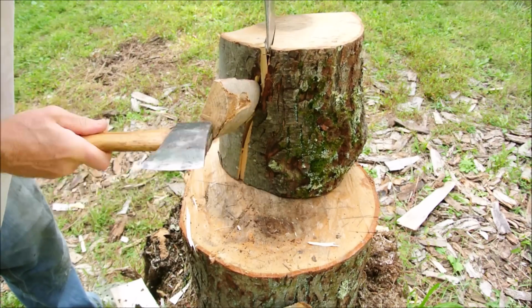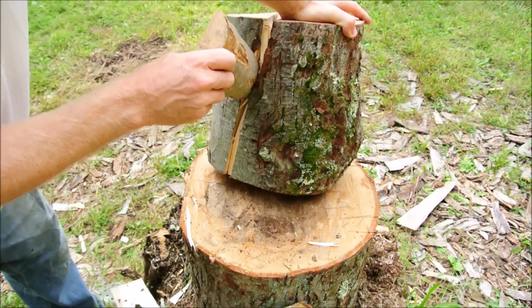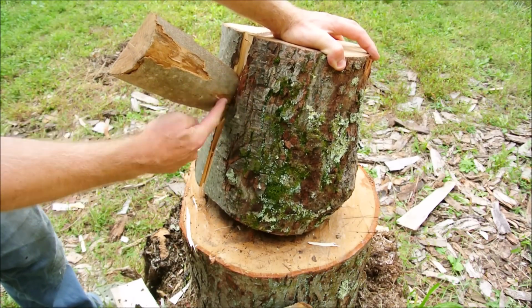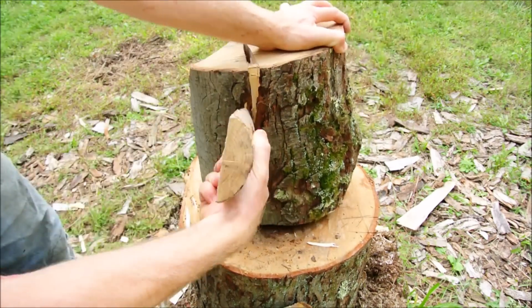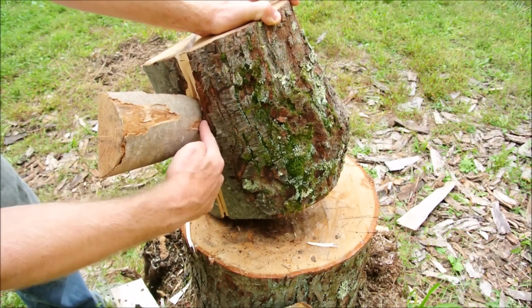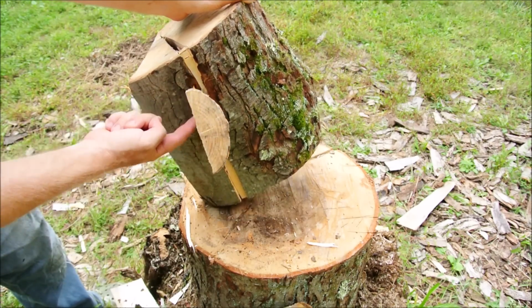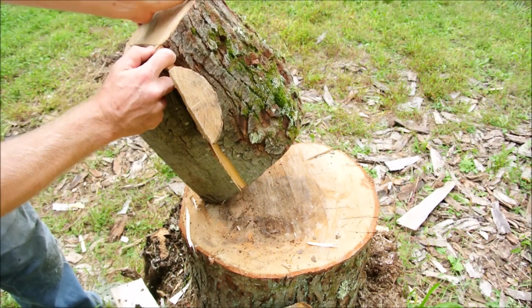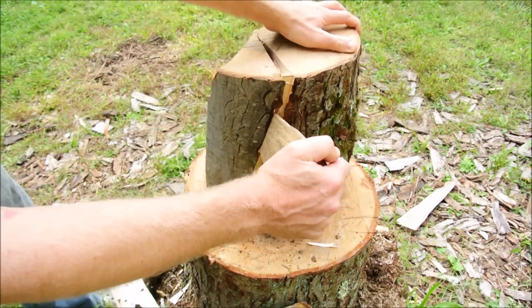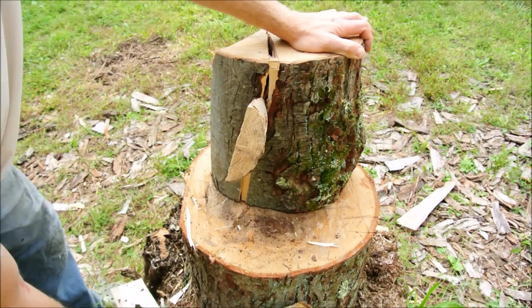Okay, so look, this is a good place to see what I'm talking about. The wedge doesn't break because, look, only the curve is tangent to a plane at only one point, ideally. And so this plane here on the wedge, it doesn't really even get forced. If you use a square wedge to put it into a curvy hole like this, it'll crack every time.